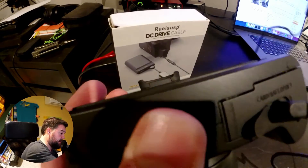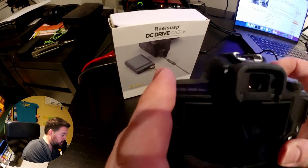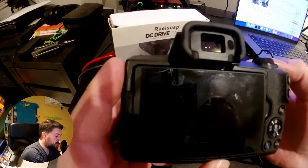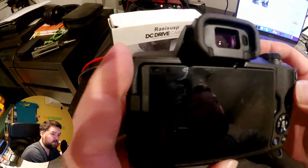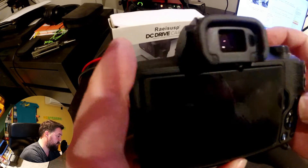I'm going to plug this straight into a USB Anker power supply and show you what I saw as soon as I first tried to get it working. There is power getting to the system because the screen flashes briefly — you try turning it on, it flashes briefly and then does nothing. If you leave it on and press the shutter it'll keep trying to flash as well, so it's definitely getting power but it's not switching on.